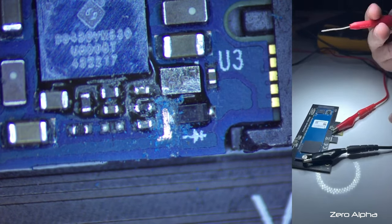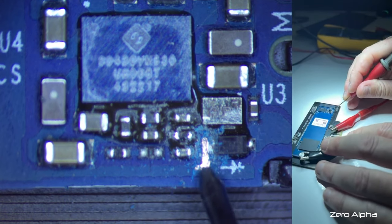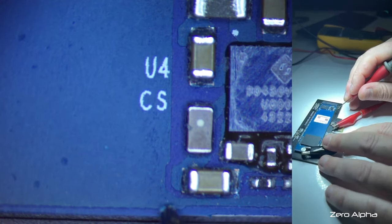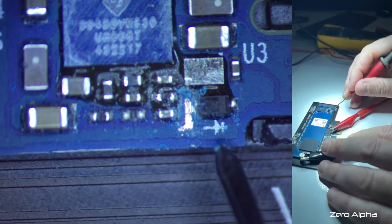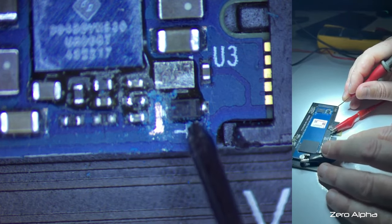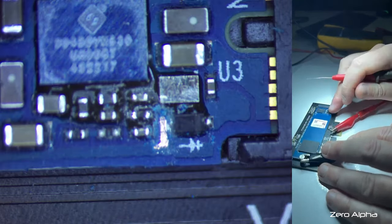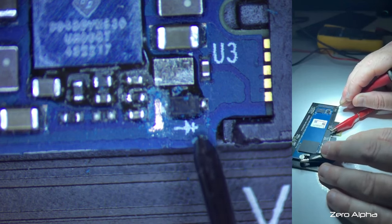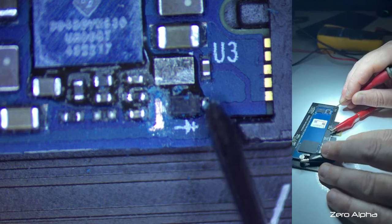I just excavated this little trace wire going up behind this diode a bit better to have a look. So it looks like that's possibly a feed line, or what is that? Goes to the ground? No. Okay, so if you look at the diode, the arrow is pointing in the direction, right? So you've got the anode on this side, and the line here, and the same line on this little white wire here, is the cathode.